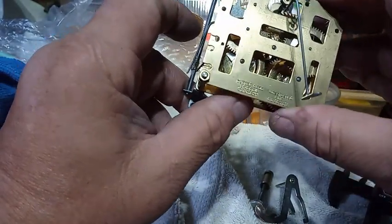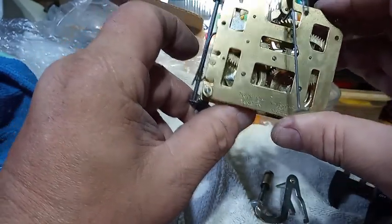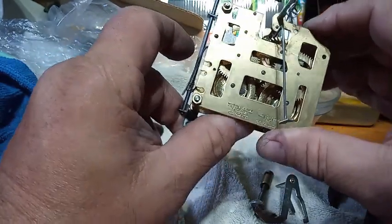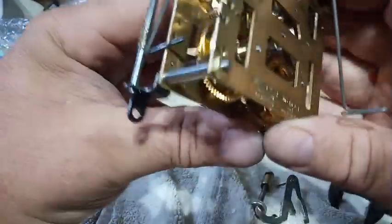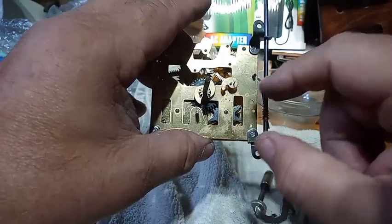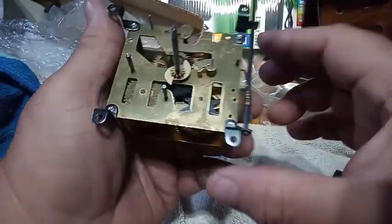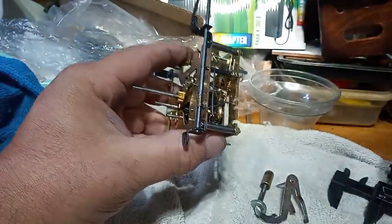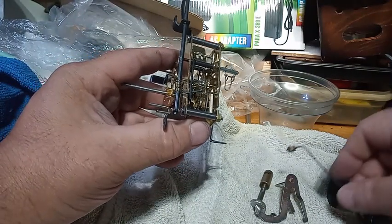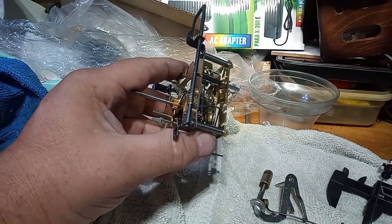And when I push the gear the right way, we'll trip it here. It goes around one time and then it catches that tab on this lever here. The Pac-Man is upside down, which is no big deal. So you could take them off and put it back on. The next step is to put your levers for the cuckoo and the gong on.